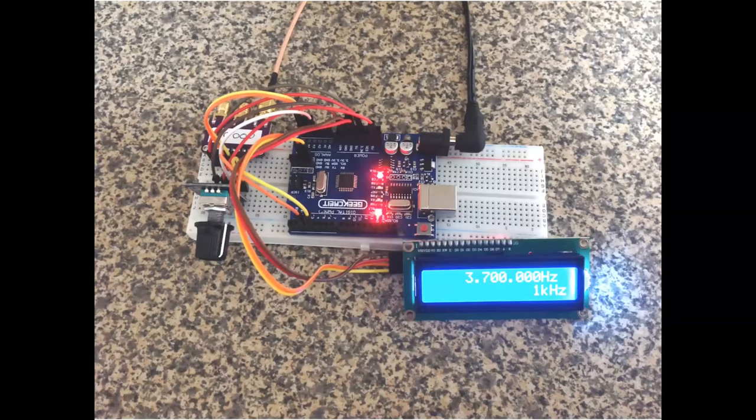What you will need to do, you'll perhaps see on the bottom left, we're just using one port on the SI5351. It will produce three independent signals if you want. If you're going to build a superhet, you'll use two of them, whereas here we're using one. You'll need to calibrate it, and there's a program that enables you to do that.